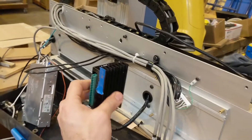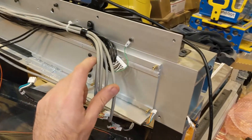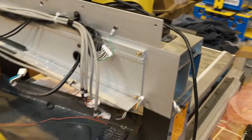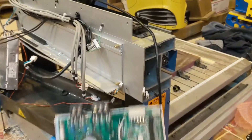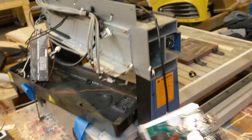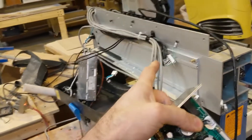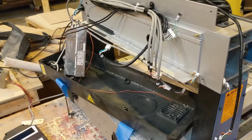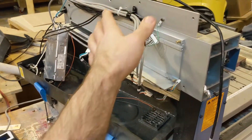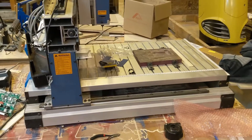Essentially what I'm going to be doing is mounting these three stepper drives right here. We're going to mount the Arduino over here and the Raspberry Pi here so we can have the USB slot facing out so we can add in our files. I'm actually going to use this spindle controller because it is a speed spindle controller. I've got a waterproof plastic enclosure — we're going to mount that out here because I think we're going to run out of space in this control box. But once this is all done, I'll have everything screwed into this aluminum rail, have this panel back up here neatly covered, and we're going to have a really cool little desktop machine with a super fast little controller in it.